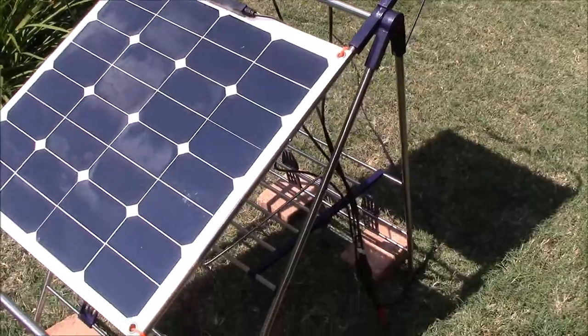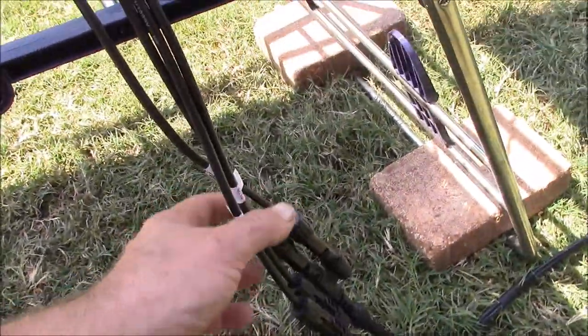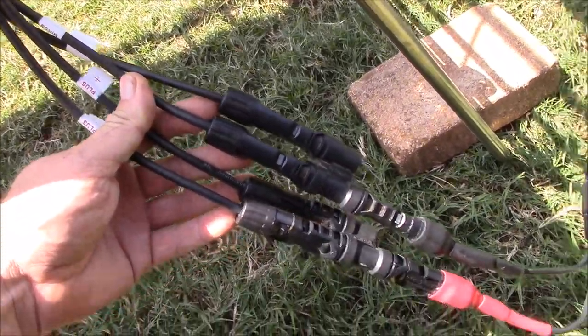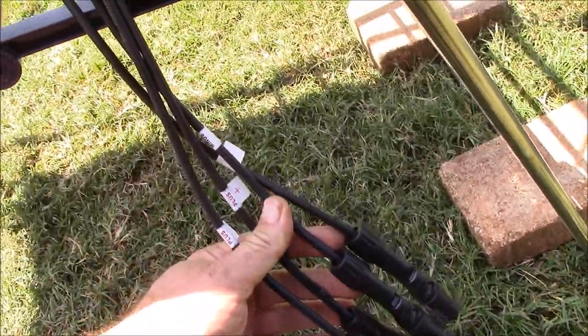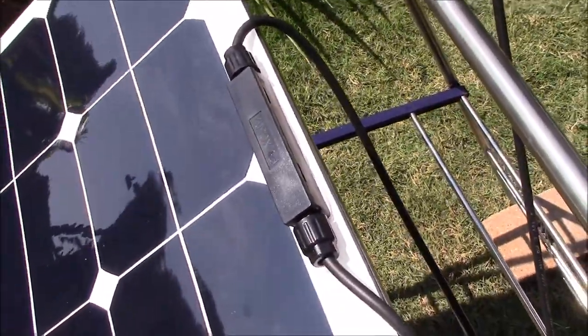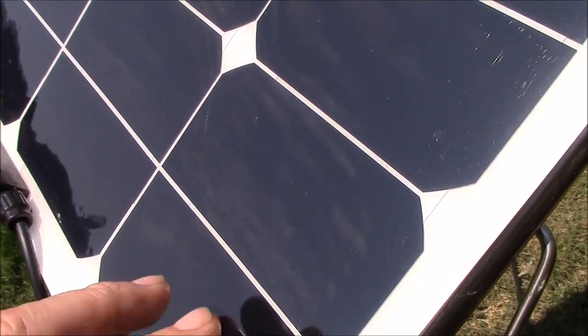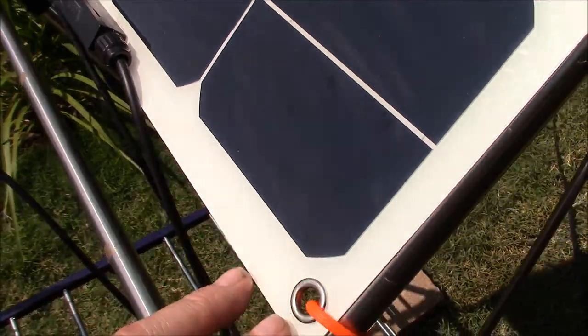These are monocrystalline panels. I'll leave a link in the description below for these solar panels and for the clothes drying rack. It's MC4 connectors there, with my do-it-yourself homemade 12-2 landscaping wire. Got them wired in parallel. I do have to say, before we get into the performance here, that these things are really kicking butt, making some great power.